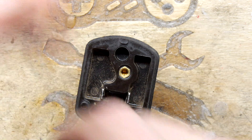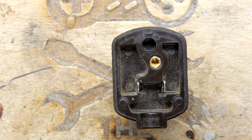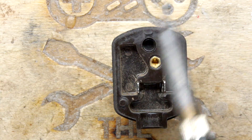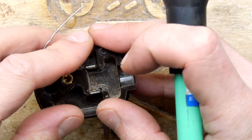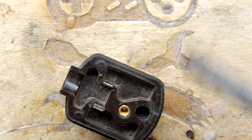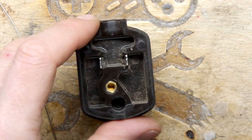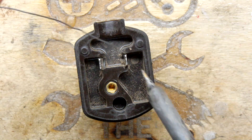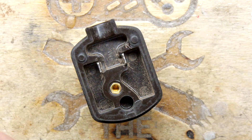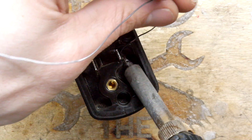So that's the plan. Setting the iron to 390 so it's got a little bit of extra juice in its caboose. I've noticed the screen is dimming when it's heating — I wonder if it's coming to the end of its life, I hope not. I'm going to turn it so we can both see, and we're just going to heat this up. Because it's Bakelite it shouldn't melt — it's pretty much heat resistant, so I can hold the solder and iron fairly close to the edge without worrying about it melting something.